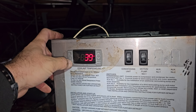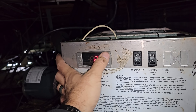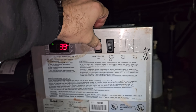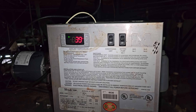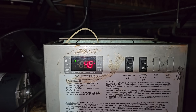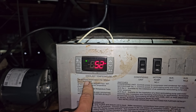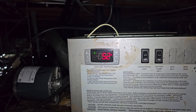I think there's something going on with the control causing the problem. I keep a universal Dixell controller in my van — basically just plug and play. I'll pull the old one out, put the new one in, plug it in. Let's set it up as TC2 and set our set point. Now we're reading 40 degrees — a little more accurate. Pump motor's on, compressor's on — we're going to let it run for a few minutes and let it drop down in temp. It's climbing in temp like it's supposed to because it's circulating the glycol and the temp is high. When I initially put the sensor on, that's what indicated to me there was a problem within the control itself.